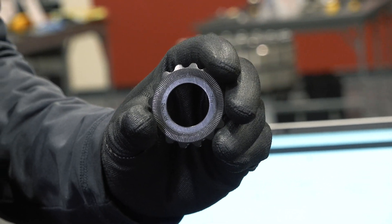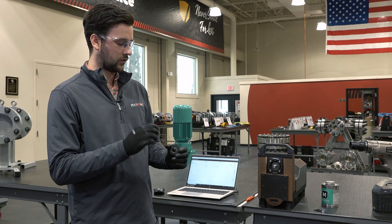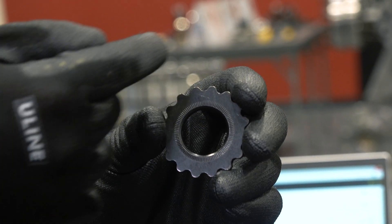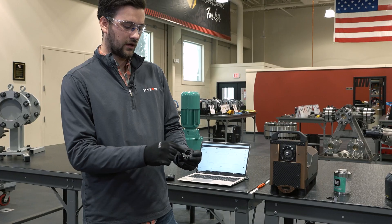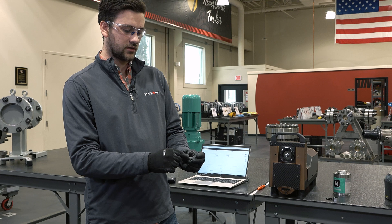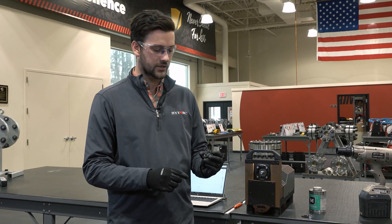We have a flower pattern around the outside that allows our tool to grab onto the washer, which eliminates the reaction arm. We also have a top side locking knurl, specifically placed along the inner diameter of the washer, in order to reduce load losses during torque from having a knurl on the top side of the washer.